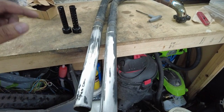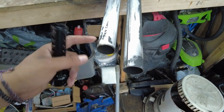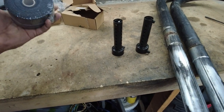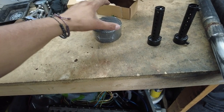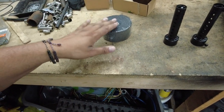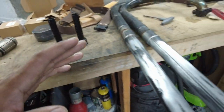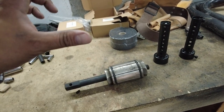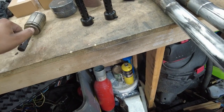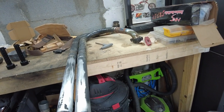Alright guys, it's the next day. I sanded the exhausts off camera. I'm gonna try to get the tool that extends this out a little bit because these aren't really fitting. I have to get a bucket of water — you're supposed to do this wet so that the fiberglass from the wraps doesn't irritate your hands. You can do it dry with a glove, but they say it's best wet. No luck finding the tool — the one I have is for two inches and up so it won't fit. Let me just throw on the wrap and I'll time-lapse it.